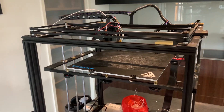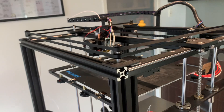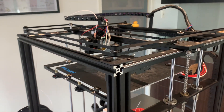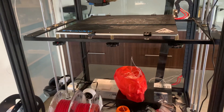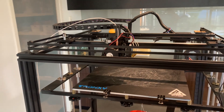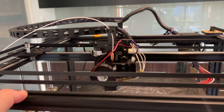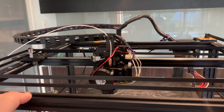There are still a couple of small gaps in the design. These brackets don't sit flat, so there's a fix on Thingiverse — though you could frankly put anything about two to two-and-a-half millimetres thick under there before tightening those bolts. There is also a design that couples the two Z motors together, but I haven't bothered with that and haven't found the need personally. The real weakness is the CR10-style print head that comes with the machine, so you're pretty much buying it for the framework despite what they tell you about the cloned Bowden extruder being a good idea.